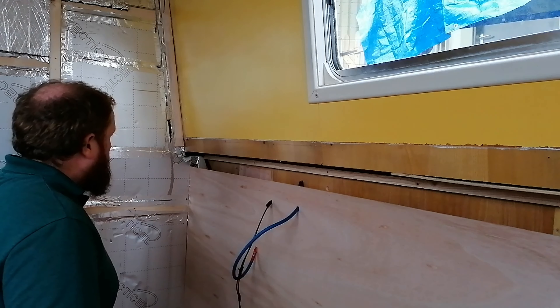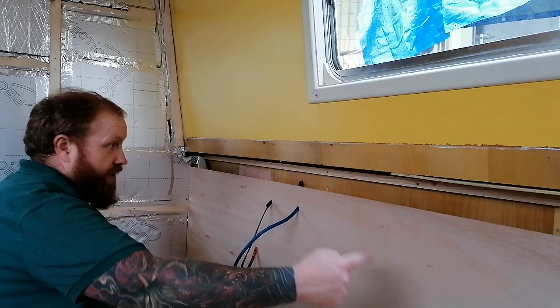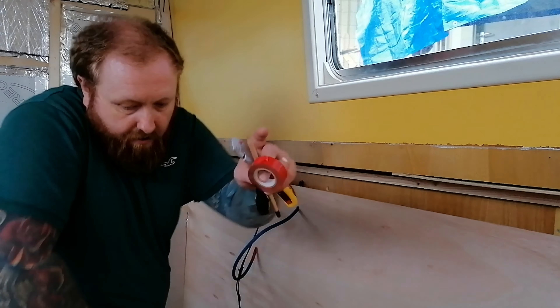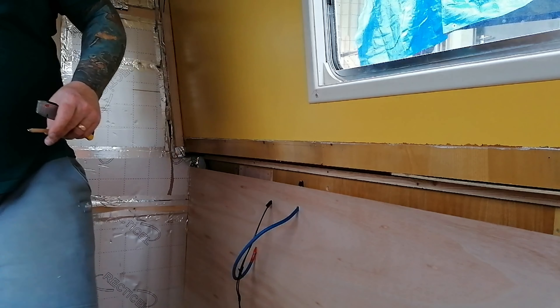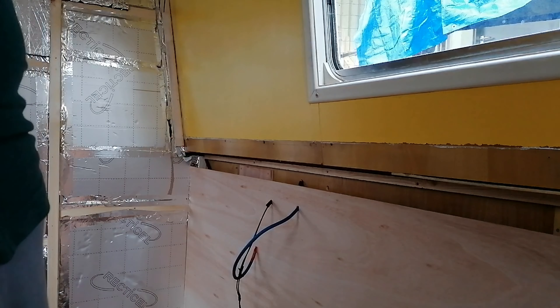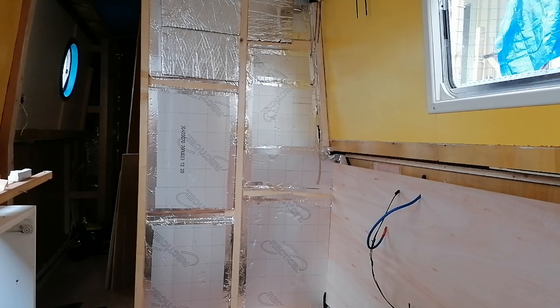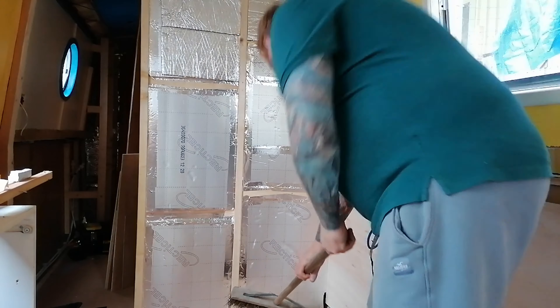What I'll do is get the bulkhead board, put that onto the wall, then put this board against it, fix it, and pull the bulkhead back out. I've got the gap right now - you learn all these things as you go along. I've made tons of mistakes on the way. Good learning curve though. Always make it nice and clean.